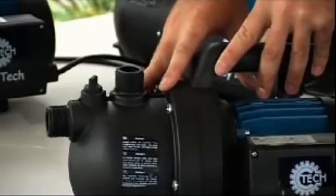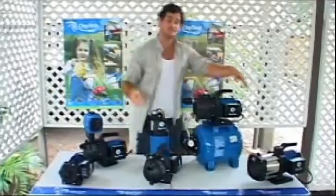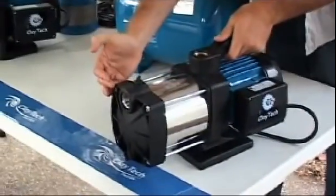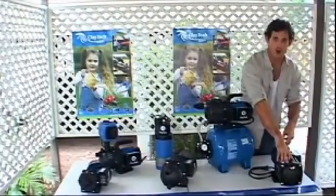This pump uses an impeller and injector to create good pressure. It is suitable for both above and below ground tanks. This is a self priming multi-stage pump. It works using multiple impellers to build up pressure. Notice the inlet is high up on the pump's casing keeping it primed. They are best in flooded suction situations and are capable of high flow rates.